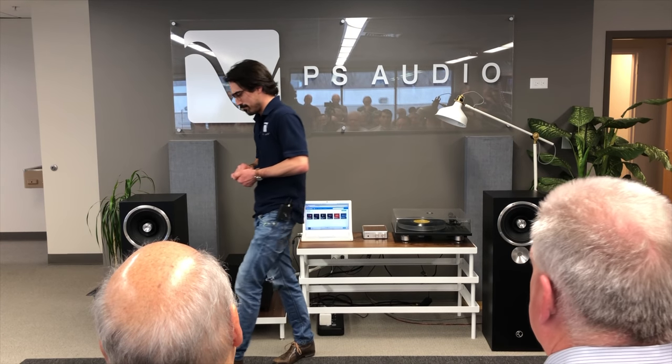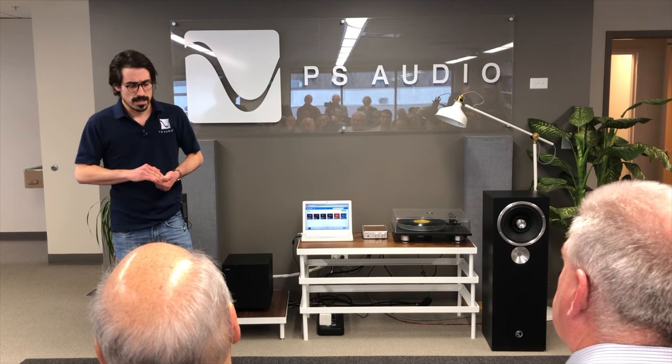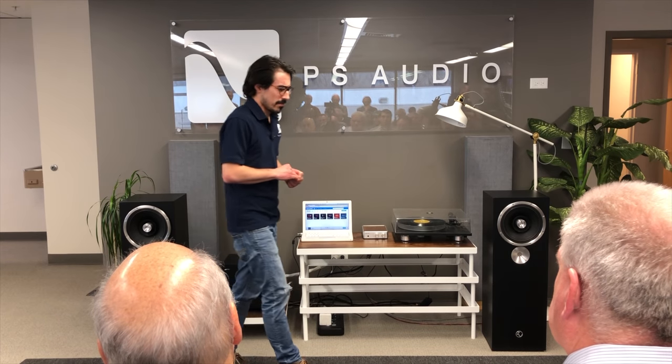I'm not saying that I'm phobic of chips. I really love them. I love to use them when I want to or when I can. But I want to do better. And so I created a circuit that only needs roughly 20 dB of feedback to create almost the same level of performance as that 2134 with a 1 million times factor improvement. So I'm only using 10 times improvement compared to their 1 million times improvement.